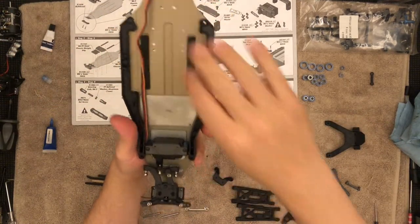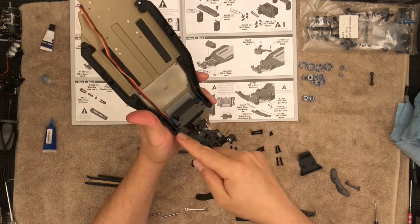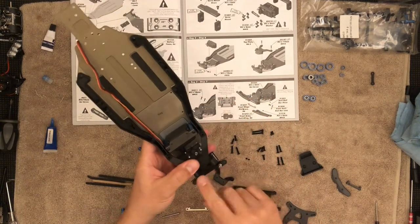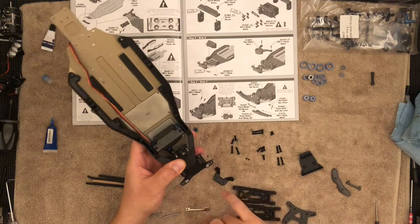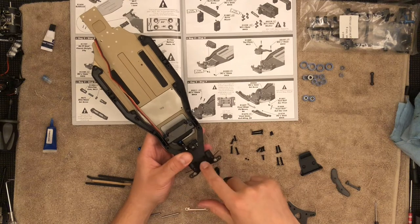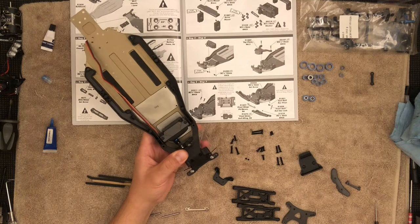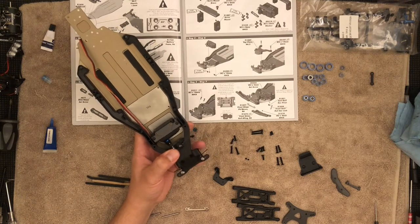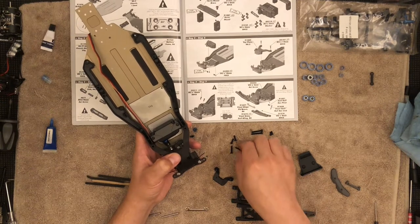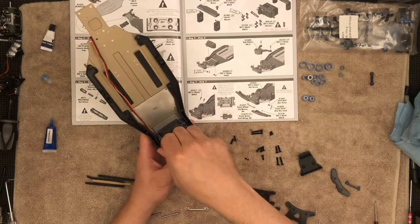Let me put this wire out of the way — it's just going to sit on top. These screws are going to go right here, right on the edges. If you ever want to replace the sway bar, you will have to remove this section here. For this we're going to install just the rear screws for now, which will be the 14mm — these long ones. They go here and there.